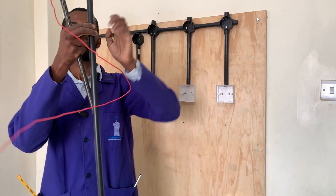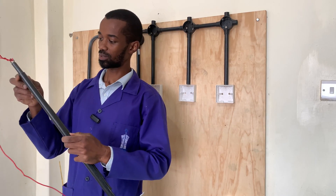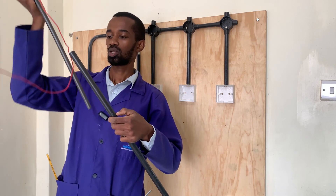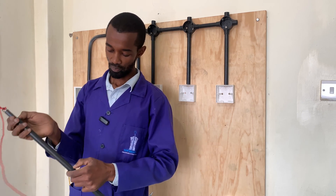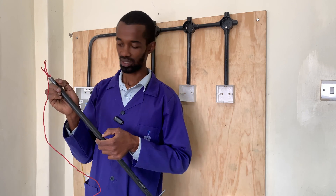Using my hand, I can mark — and there we have the bending spring. We can see it is still outside. So you just mark here where you are supposed to bend. When inserting the spring, we ensure that it gets to that point so that when you bend there, you are perfect and sure.